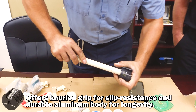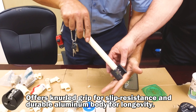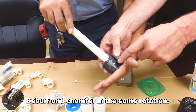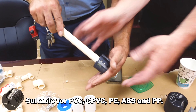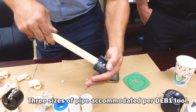Frank is actually inserting the CPVC pipe into the re-tool tube and he pushes it into the depth right there. You'll see the pipe against the depth of the pipe because this goes from half to one inch, so that depth is three-quarter. And then as he's firmly pushing against it, he's rotating the pipe 360 degrees to bevel the outside edge.